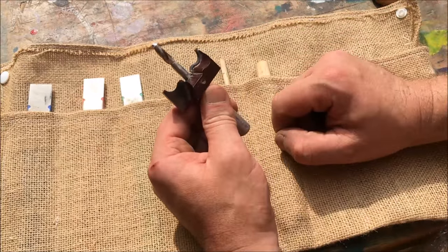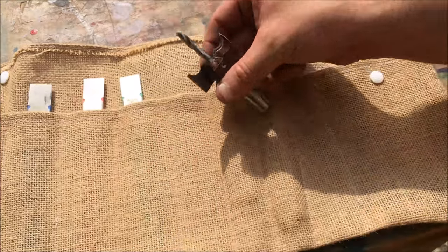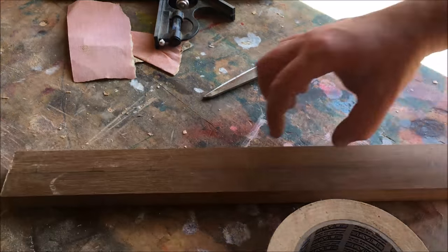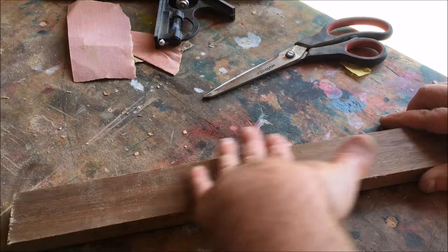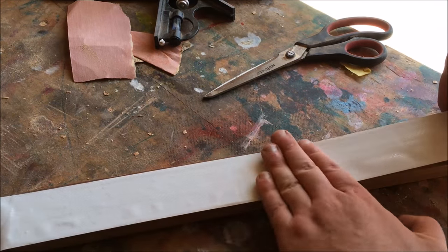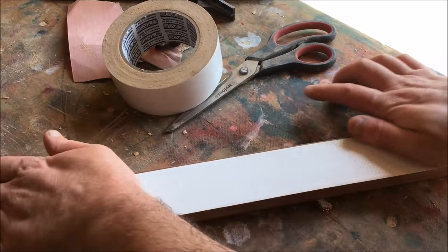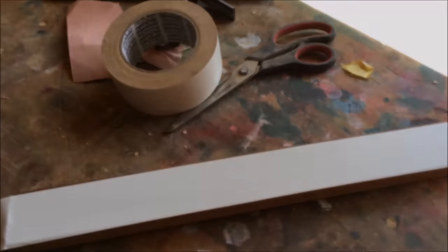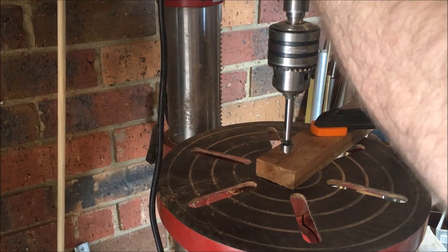If the blade is even worse and the front is chipped, it's time to throw it away — not many people working in the garage have the skills to sharpen that. For setup, I've got a strip of wood marked out with spots five centimeters apart, giving room for the four centimeter cutter with some clearance. On the underside I'm laying down cloth tape to strengthen the back, so when I drill the six millimeter holes all the way through it reduces tear-out. Masking tape isn't strong enough, but cloth tape does the job fine.